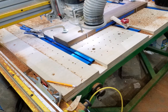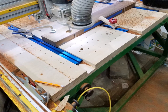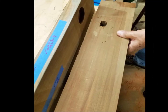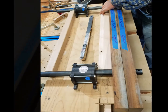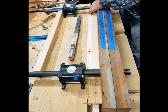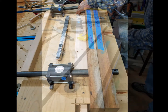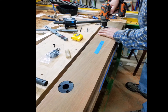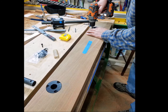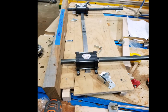Then with confidence that we gained from the rear jaw, we went ahead and bored the counterbores and the rectangular holes that allow adjustment for the front jaw. We set the shafts in place again and after ensuring that the shafts move freely through the jaws, we placed a strip of wood between the fronts of the jaws and the backs to keep them aligned. We mounted the Delrin bushings in the counterbores of the rear jaw and set up the housings again, this time with the gear racks under the pinion gears and fastened everything in place.